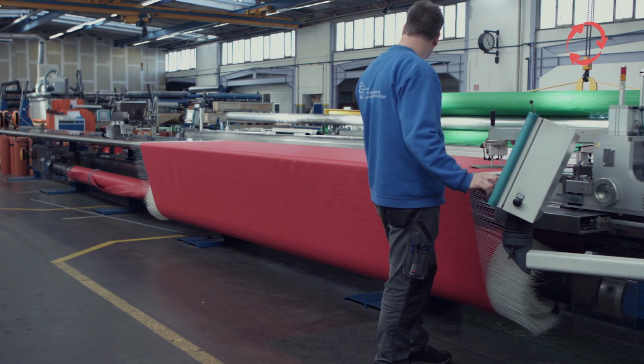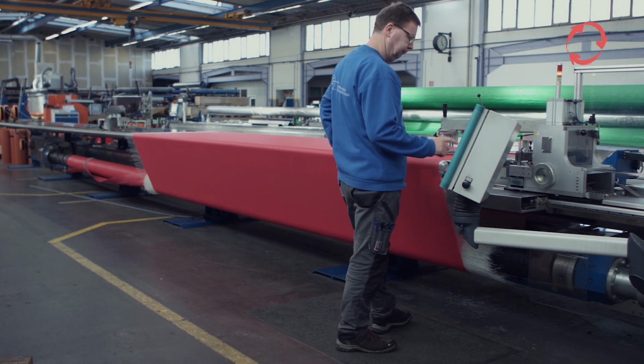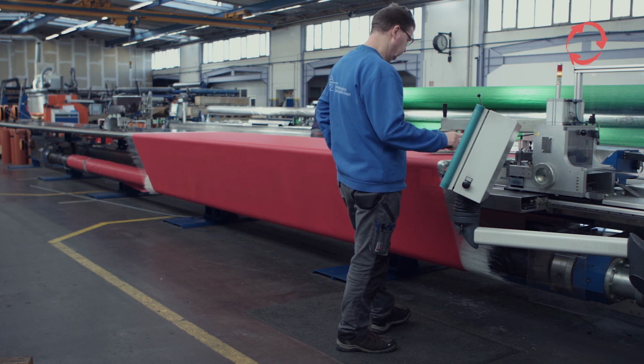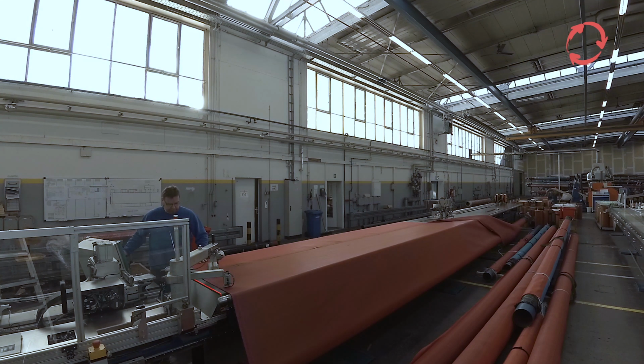The sieve is now completely wrapped backwards under tension. Make sure that it is wound without diagonal pull. If necessary, correct with side adjustment. The complete sieve is now on the rear tube. Before rewinding it again, the sieve must be moved laterally so that the sieve edge matches the table edge.